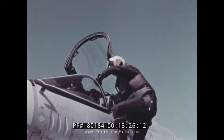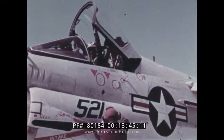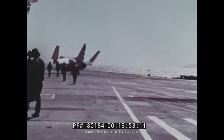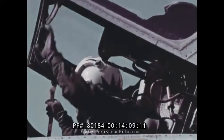On the way out, make sure you don't hit the throttle or pop the bailout bottle with your feet or flight gear. The same caution applies to the switch pilot as he mounts and moves into the cockpit. Pull the brakes and strap in. No post-start checks are required, but the take-off checklist should be completed, except for wings and compass alignment. After returning from a mission, keep the engine running until chocks, downlocks, and at least three tie-downs are installed. Execute a normal shutdown when the cut signal is received. Control the canopy opening rate by holding rails with both hands, and install the canopy strap immediately. Always raise flaps prior to a shutdown, even underway on the hangar deck.